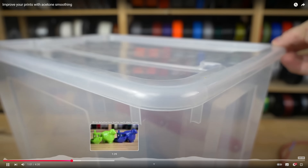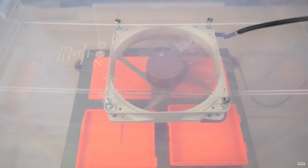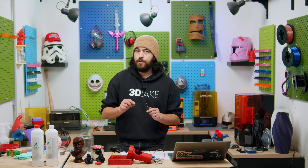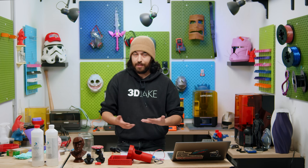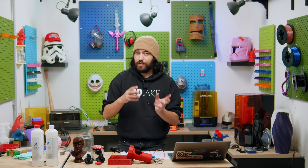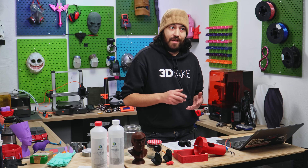Prusa also made a video with a slightly different approach where they used a huge IKEA box with a hole in the lid where a fan was placed that circulated the air around, so they didn't need to rotate the piece. This is great for larger projects, but keep in mind the materials they used. The box was made of polypropylene, which is resistant to acetone. If you use a different kind of plastic, you're going to have issues. Also, the fan they used was a Noctua fan — Noctua fans' frames are made out of PBT polymer and the actual blades are made out of liquid crystal polymer. Both of these are resistant to acetone. If you use a standard cheap fan, that's almost certainly going to be made out of ABS, and you're going to have issues with that.